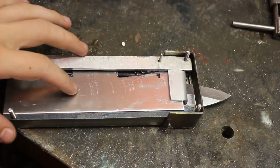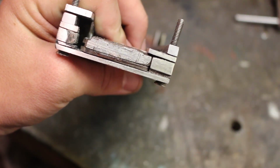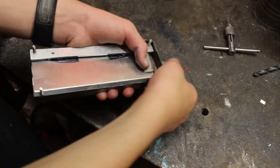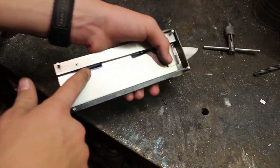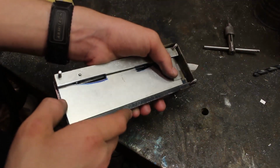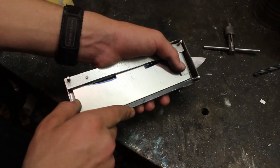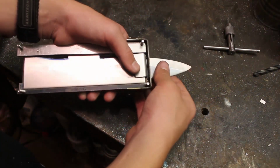And I'll just do a quick overview on how the hinge blade works so far. The track will assist the knife on not budging when it's at the end of the track because, as you can see, it goes under one of the layers. So at the moment, the blade can't move forward at all. It's locked in place. So with the help of the slide, as you can see with this curve here, it'll wedge the locks unlocked. So as I move it forward, it moves that lock out of place, and the blade can move forward all the way to the front.